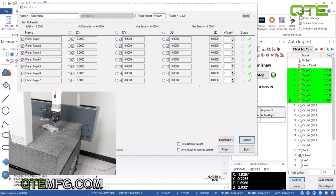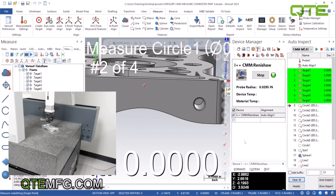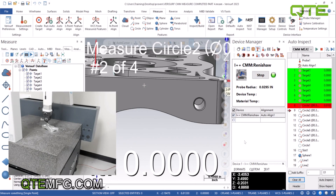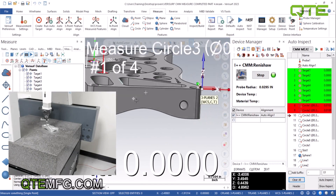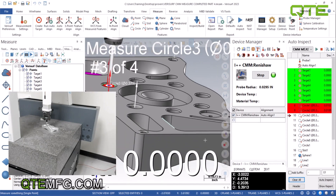From there it's good — we'll accept it. If this is a first-time run, you need to make sure you're careful and slow down the speed of the machine, because you don't want it taking off when you're not sure what it's going to do. I've ran this program before so I have it at full speed right now. As you can see, when it's going into these holes it goes straight in right down the center of the hole and then it's just flicking — that way it measures a lot quicker because there's no CMM movement, it's all movement of the PH20 head.